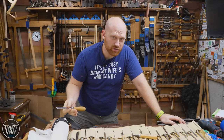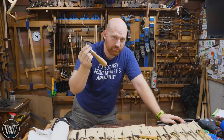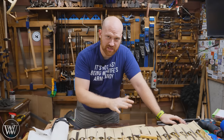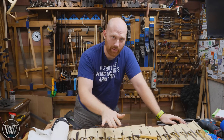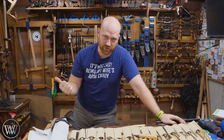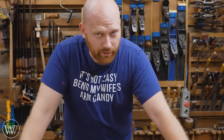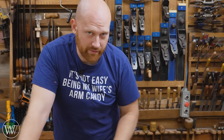I generally don't talk about sharpening systems as much, because whatever sharpening you're going to be using for your bench chisels is going to work for most of your regular carving chisels. Most of the time, I do not let these get dull enough that they have to go back to my sharpening stones. I keep a strop on the bench, and I strop them every 5 minutes, and I keep them sharp. You keep them honed, and you'll never have to take them back and sharpen them, unless you drop them on a concrete floor, and then you're gonna have to do a lot of work. And that's a whole nother video. So I'll leave a link to those videos down in the description below with all the others.